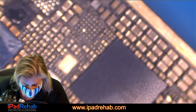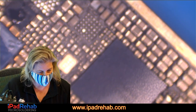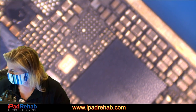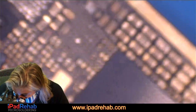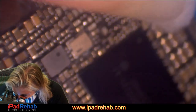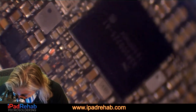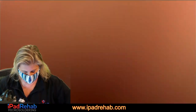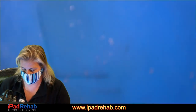Okay, well, I'm going to save that Maggie. It doesn't look super, super ugly under there either. All right, where is... Okay. Do we still have a 200 milliamp leak? Yes or no? Let's find out. All right. 200 milliamps. Yes, we still do.